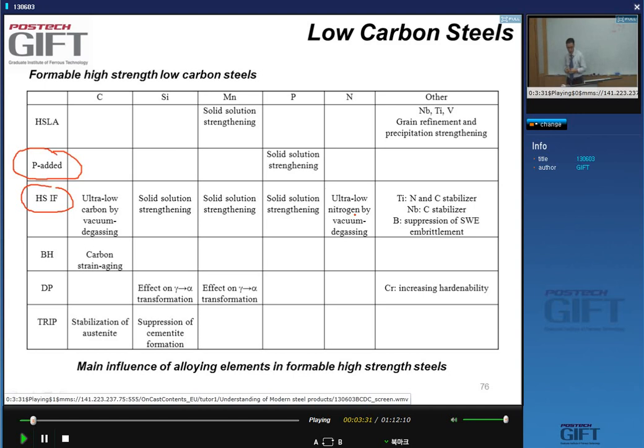The other thing is, of course, when you start adding manganese, around 4% of it, yes, the material starts to have other properties. It will air harden. It will very easily turn into martensite. Okay, so you get into another situation, basically, of behavior. And what we see in general, when we're using manganese just to strengthen, typical amounts that we add are 2-2.5%. That's about the maximum, right?